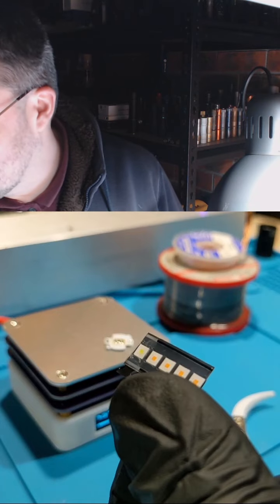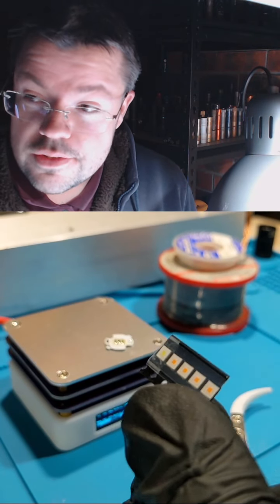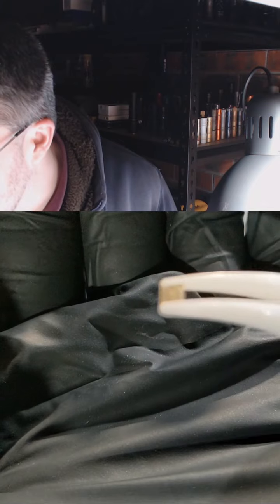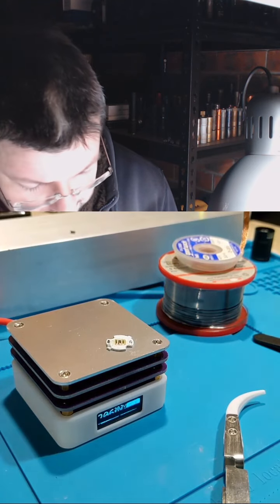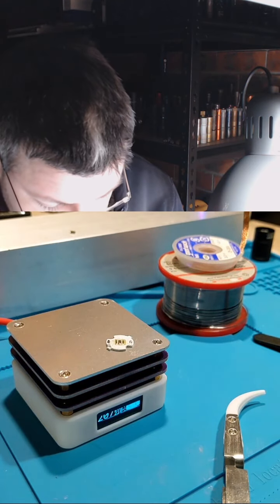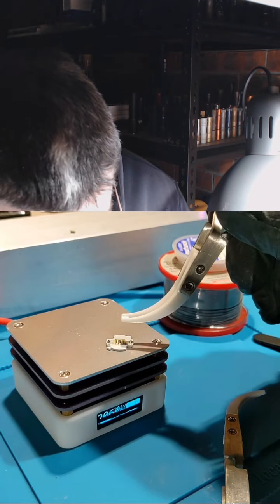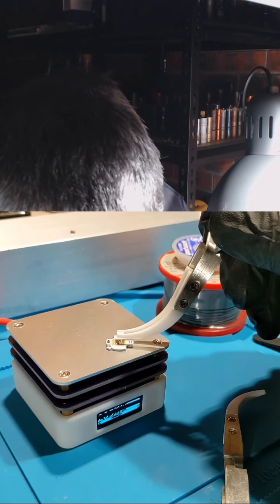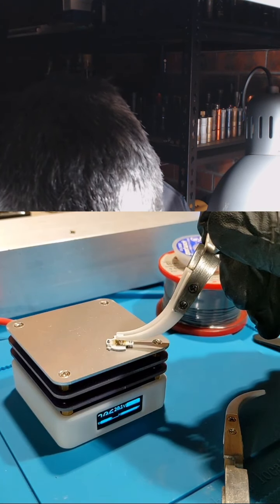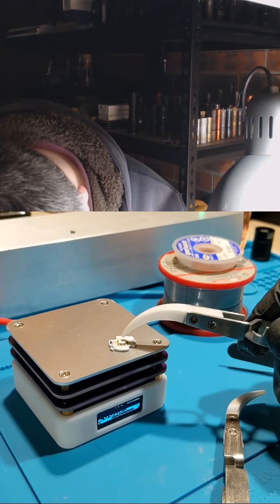And I'll take out one of these amber Osram NM1 emitters. So really throwy. On the back of the emitter, there are 3 pads, and there should be the anode marker on one of them. So I'm just going to guess and point that towards this way. Hopefully it's correct. The pads are not the right size, so hopefully it lines up. It's probably way too much solder.